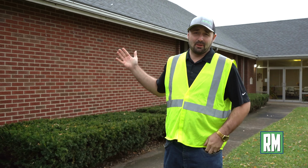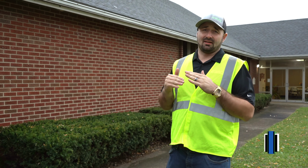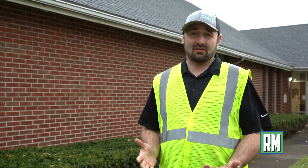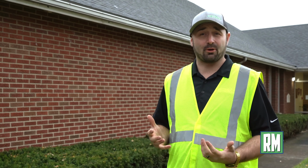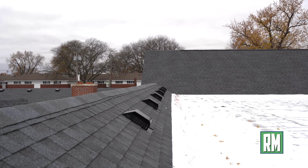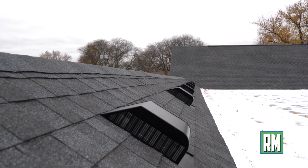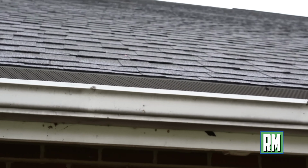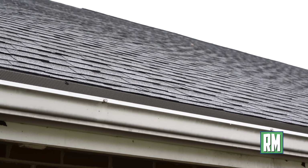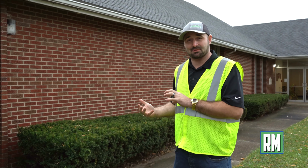On these old church buildings with cathedral ceilings, a lot of times there's no insulation underneath or no ventilation. Unfortunately, to follow code, you have to add more ventilation. So our solution to this problem was to add new decking, elevate the roof system 1/4 of an inch or 1/2 inch, and then add vented T-drip edge. That way we have air flowing in underneath the shingles and the decking, keeping the attic space 10 degrees plus or minus the temperature outside.